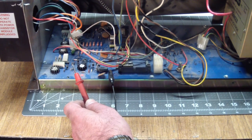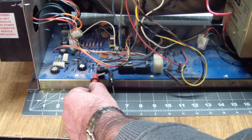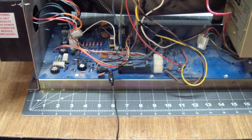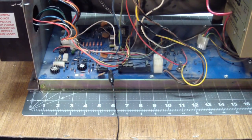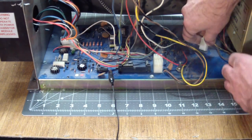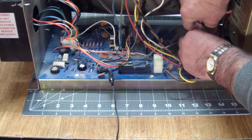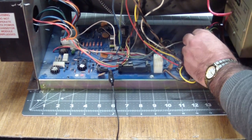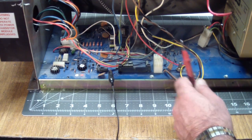And turning on the meter, let's see what the actual... So we're getting a reading in the kilo ohms now. So obviously the fault is either in the high voltage supply or in one of the transistors mounted on the side. So let's plug things in. First, the high voltage supply, because if that thing's dead, I don't think I can get a replacement. Well, I probably could if money were no object, but hey.